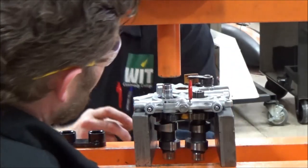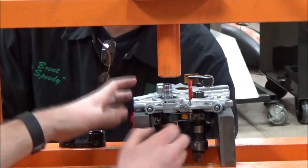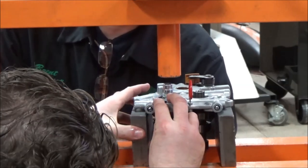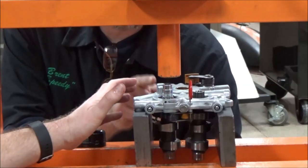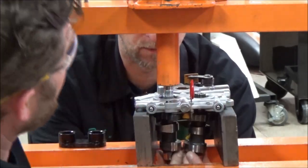We're going to hover underneath here, and something else we're doing is when you support something in a press, if I have these press plates all the way out here, that's going to take a chance of bending the support plate. You really want it to be as tight as possible without actually touching the inside parts so that they have room to move. Hold both cams there because they're going to drop out in a second.